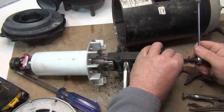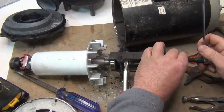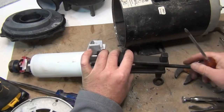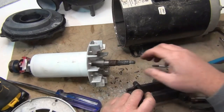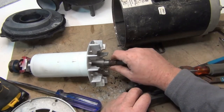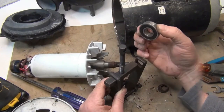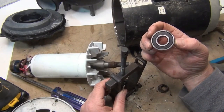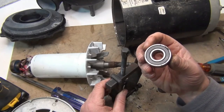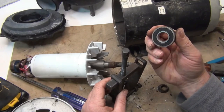As you're doing this, you'll start cleaning off the shaft all the way up. The shaft's pretty worn down — clean up all this as best you can. You can see it's all worn down — this is supposed to be the same diameter throughout. If you're looking for a replacement bearing, all the information is right on it, but this one is blank. Normally the number is stamped on both sides. We have a video on how to measure a bearing, linked below.